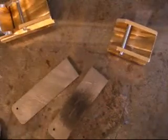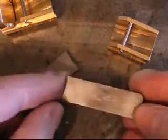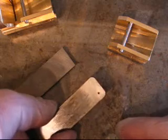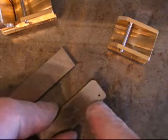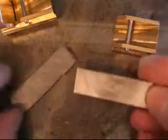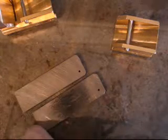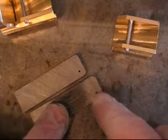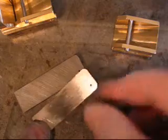These are the irons for the luthiers. This is a slab of cast iron with a piece of 1/8th polycarb on it — a very handy way to work. These are the irons themselves, hardened and tempered. Because I enjoy making the same product and modifying on successive batches, I've used a little small suspension hole so that when these things dangle in the flame among the fire bricks for hardening and tempering, instead of the iron wire making contact with what will be the cutting edge, the iron wire suspends the article merely from the top, so it's clear of what will be the important bit later on.